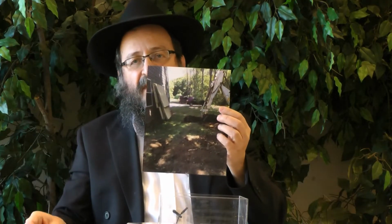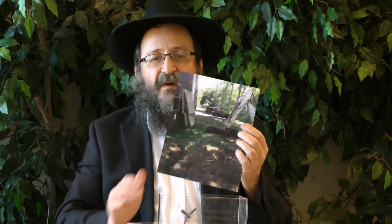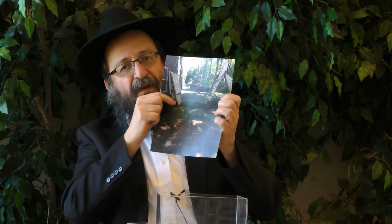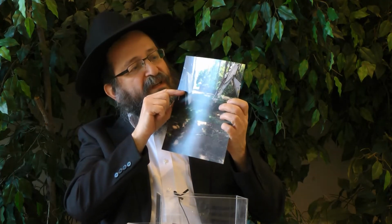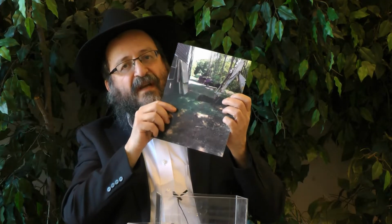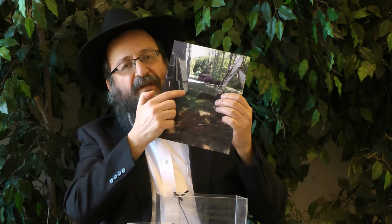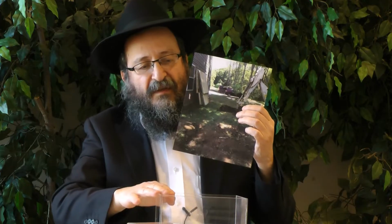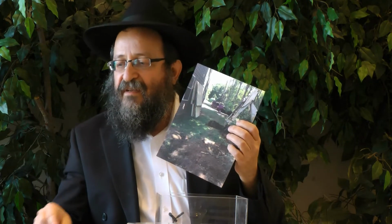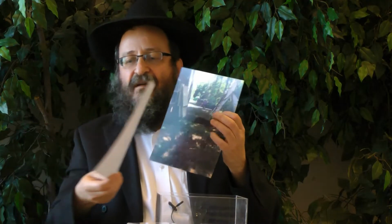Day number one. The Sunday afternoon, we went ahead. One person, a carpenter, went ahead and built a frame. 4 walls, 4 frames. If you see, the top part is 70 inches, the bottom part is 30 inches, and it comes in a little bit, so when the cement, I'll show you in a minute, when you pour the cement, you're left with an indent. So you have 4 of these forms. The following morning, Monday morning, the tractor came and dug.